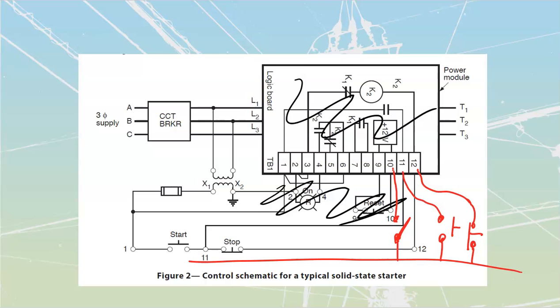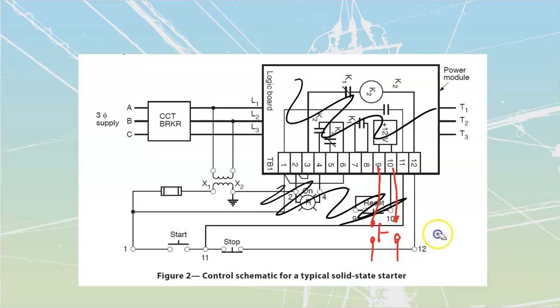A common way a lot of electronic drives work is a single hot stinger with a single tag off of every device. We still have a normally closed for our stop. For forward and reverse, it doesn't even need to be two positions — the digital logic can say if the switch is open it's forward, if closed it's reverse. A single input handles that. We might also have a normally open for reset after an overload. Expect to see that a lot on drives.